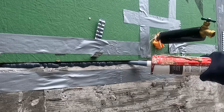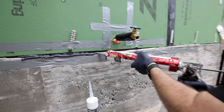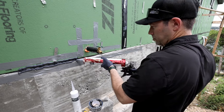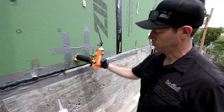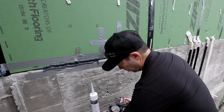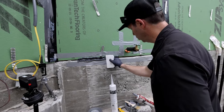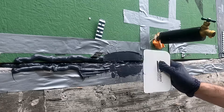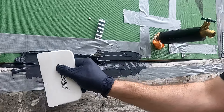We're going to come off onto the foundation and onto the sheathing as well, and we're going to strike that joint and tool it. If the gap was tighter, you'd use less product, but because we've got a pretty loose gap in there, we're going to use a fair amount. We're just going to take our scraper, spatula, or chip brush and strike it down and tool it in place, pushing it onto the concrete and making sure it's into that joint. That nice tooled joint is really what we're looking for.